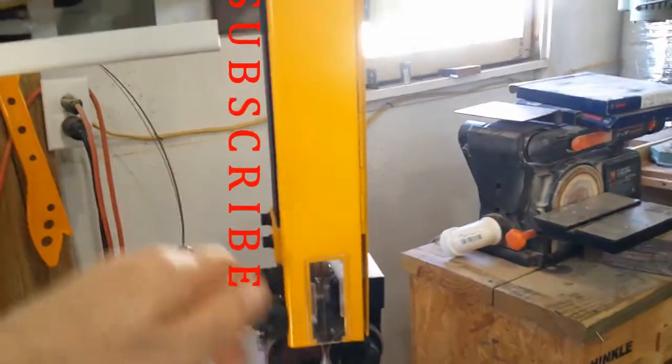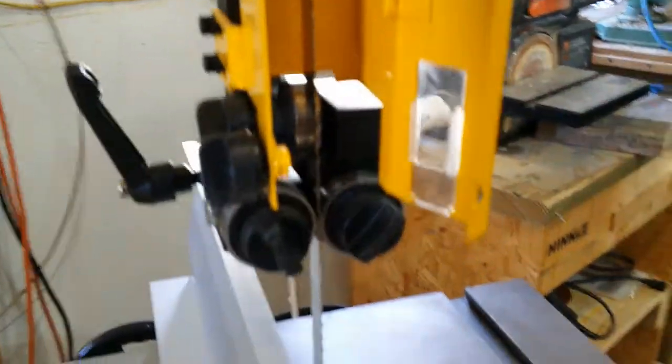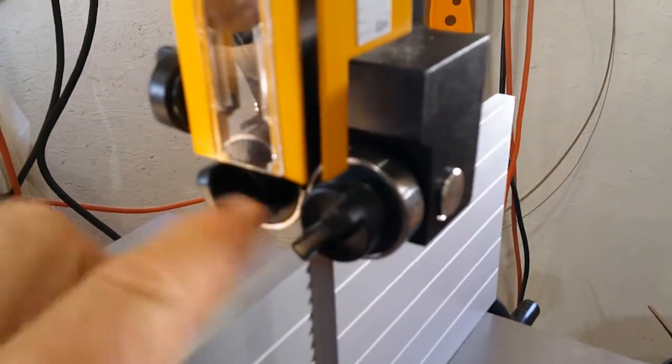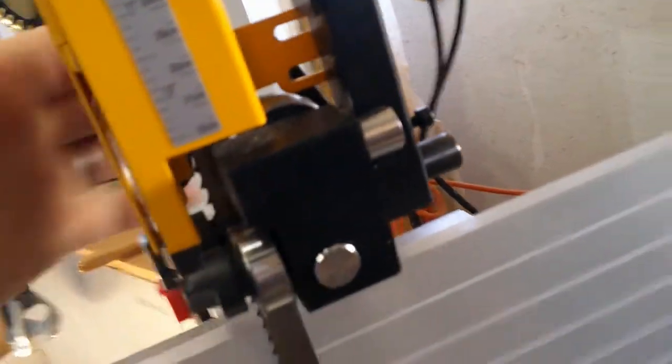Blade tensioner up here on the top. This little box here allows your safety post to go up through once you raise it up. Here is your guard — if you open this little block here you can access the blade and the blade guides. That's one of the major features on this saw: tool-less blade guide adjustment. You turn these little knobs right here and they are spring loaded. They will go in and out and you adjust them accordingly. Same thing with this bearing back here — the knob is on this side, the shaft is here, and you can slide that in for the back bearing. It's identical on the bottom.